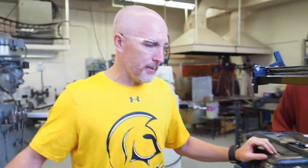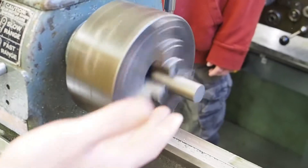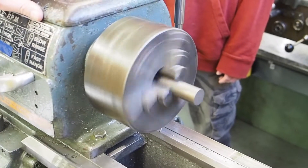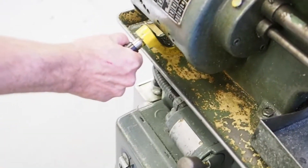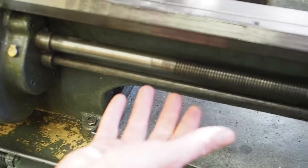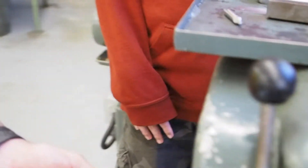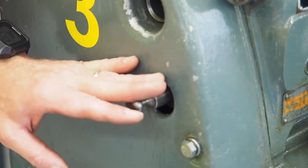Rule number two: keep hands clear of moving parts. There aren't a lot of different moving parts, but here are a few. As we turn the lathe on, you'll notice the moving parts right here — this is pretty much it. When we have our guards down, it's pretty impossible to get our hands near it. But if you're using the automatic feed, you'll notice that these bars spin as well, so you have to keep your hands clear of them. This is where you've got to be careful you're not wearing baggy clothes because it could suck your baggy clothes in. And one last moving part — out here on the end, this piece is spinning as well, so as you walk by the lathe be sure you keep an eye on it too.